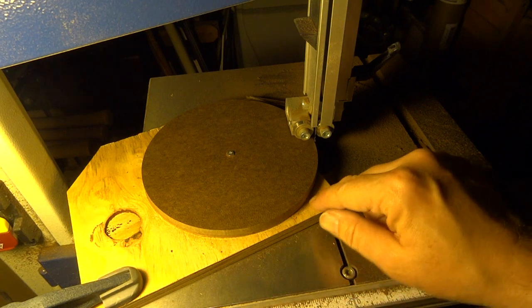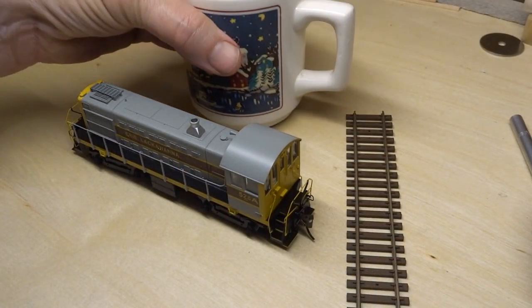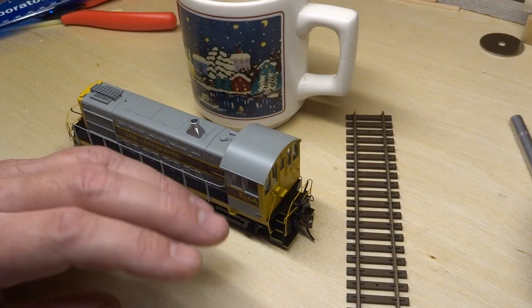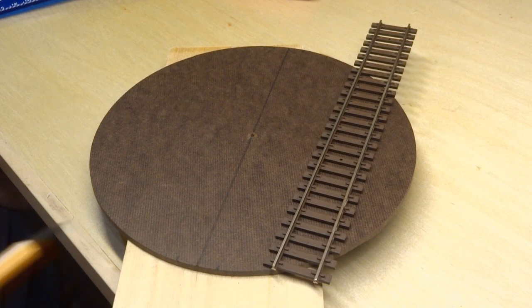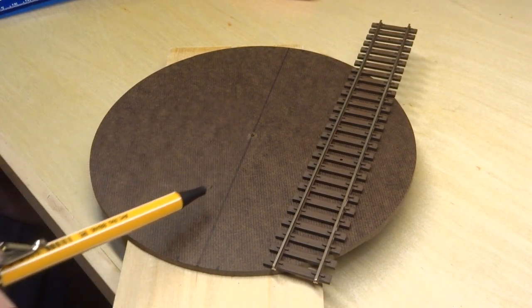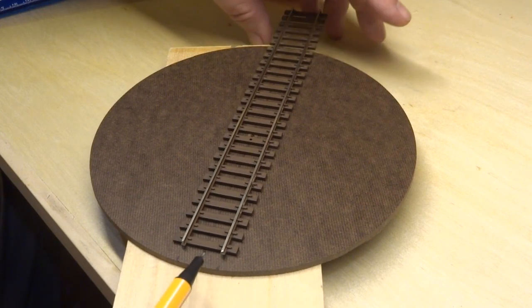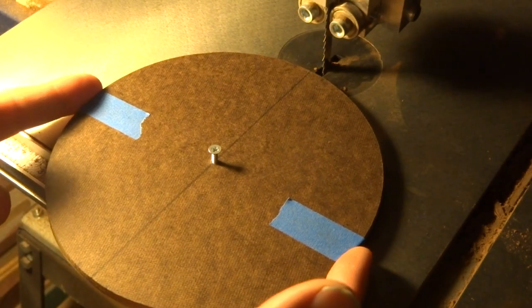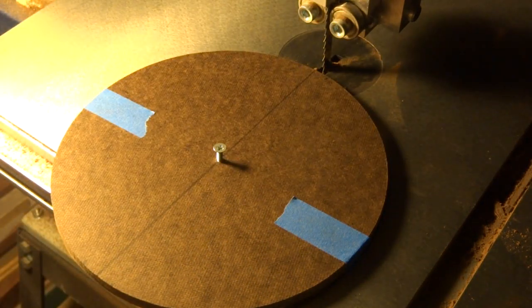For this last pass I did all three discs at once so that they would be relatively the same diameter. In any one-of-a-kind project like this, there's plenty of thinking time — how is this going to work? On one of the discs I marked out the center line and the spots just below where the rail would be to see how this will line up, and I marked it on both sides. Next, I put two of the discs together, holding them in registration, and I'm going to cut two little slits under each rail on each end, about a quarter of an inch apart. I'm making this up as I go along, so fingers are still crossed.